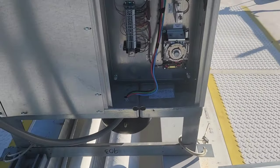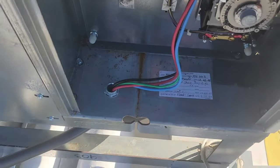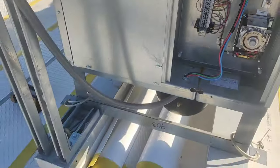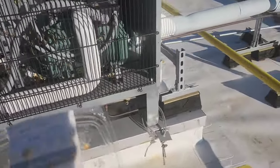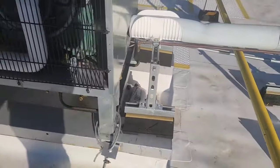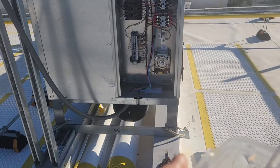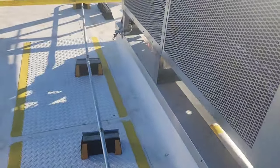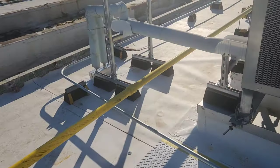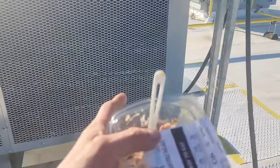Here's my condenser. Notice we've got three-phase power coming into it, and that's all we have for wiring coming to it. That's it. So right then and there we know that this thing is purely pressure controlled — there's no control circuitry or control wiring energizing or de-energizing the solenoid valve down there. That is coming from this machine.